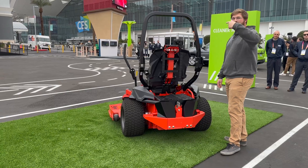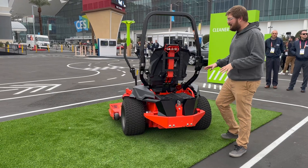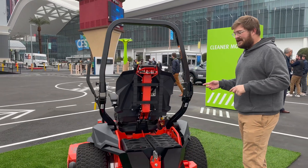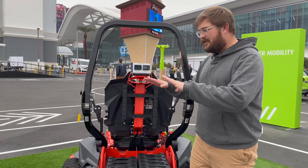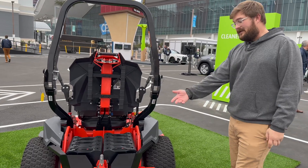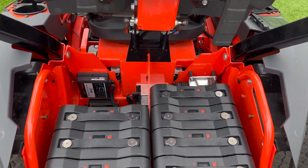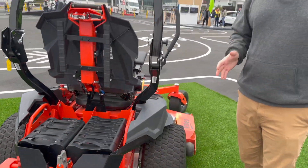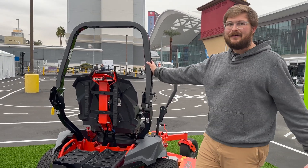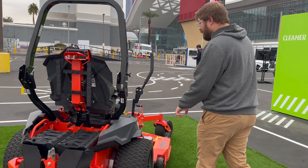The dream is to have your work vehicle charge this from job site to job site. In terms of runtime, they've done testing with this 14 kilowatt-hour battery pack — each brick feeds a slightly different system here, but in mass production the whole pack would feed all components evenly. They claim five to seven hours of runtime depending on use, with five hours being worst case. Throw it on the truck, charge at seven kilowatts for a couple of hours, and you're good to go.